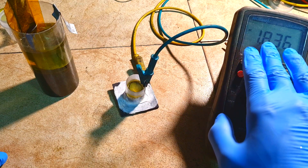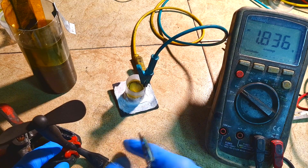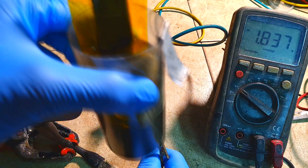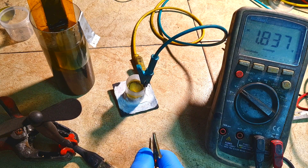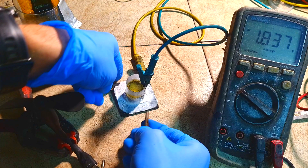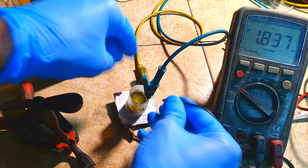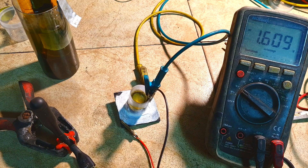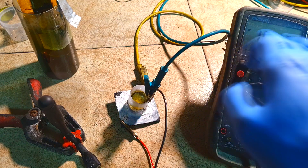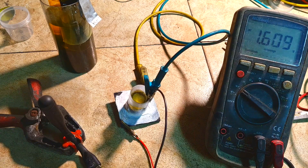Back again to this cell — the voltage is 1.8 volts right now. Now I will connect this 100 milliamp load motor to this cell. When I connect this motor to this normal zinc bromide gravity battery, the voltage drop on the load was really really high. Let's see what voltage drop I get on this improved version — and this is really great. The voltage drops from 1.8 volts to 1.6 volts, and on this one I get a much bigger voltage drop.